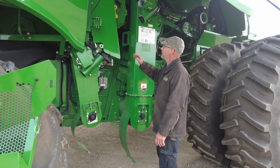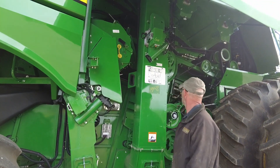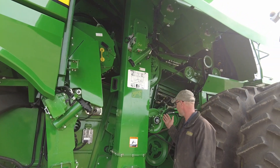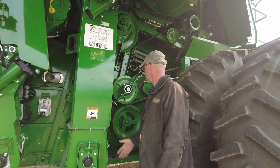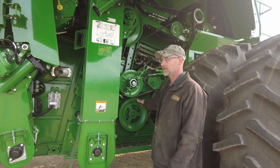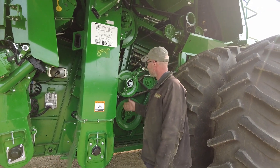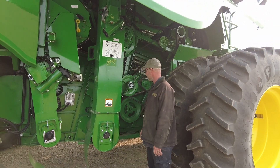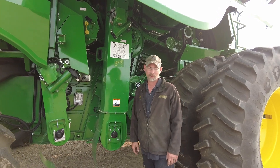As we switch over to grain, we want to make sure that we're moving our re-thrasher down onto the grain setting. On this side we're going to look at our fan sheaves — make sure they're in good shape with no bearing issues. Check the condition of our fan belt and all of our shoe drive belt. Same thing — look at the arms on this side, check the bushings really closely, and make sure there's no sign of cracks or wear on the arms.